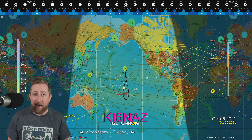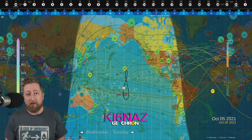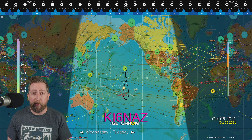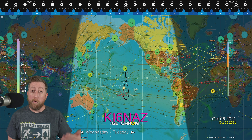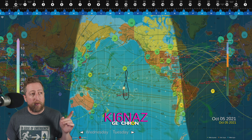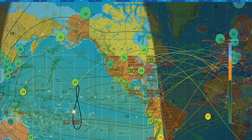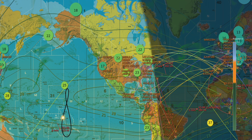This is a very busy screen. I actually sometimes have the DX off just so I can focus on the maximum usable frequencies and the satellites, because I do have the FM satellites displayed. For those that are new, a maximum usable frequency or MUF display is showing you what frequencies where two-way communication is possible. I'm at my home location in Southern California. If I wanted to talk to the East Coast, the maximum usable frequency is roughly about 22 to 23 megahertz — kind of right in between me and the East Coast. So it gives you a quick snapshot of where you might want to try and make a contact. So 20 meters might be good, and 17, 15, et cetera.